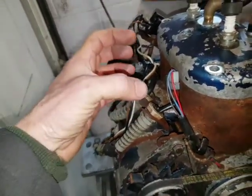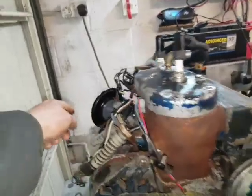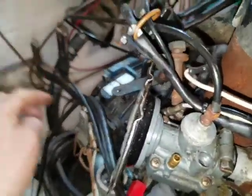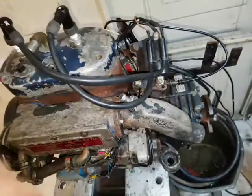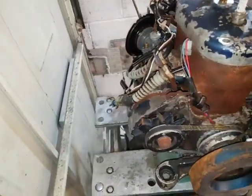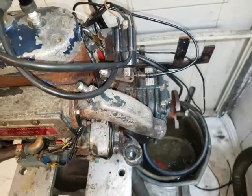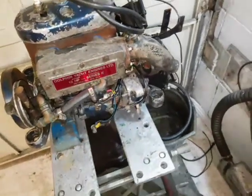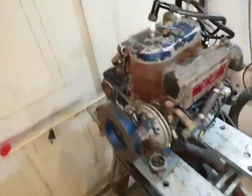If you look at the Vire, the carburetor is right up here, right where you can get at it. You can change all the linkages, the adjustments, same with the gear stick. With the Dolphin, it's all very deep behind. I don't know how you would get down there and adjust the linkages for the gears or the throttle. The only way is to basically make sure there is a hatch you can lift up in the aft of the boat, which this gentleman had, but obviously that compromises your safety in a storm where that removable hatch can leak or even blow off and sink the boat. Most boat builders recommend that there isn't a resealable hatch in the cockpit because it's self-draining and they don't want any issues, plus it weakens the structure of the boat a bit. So with the Vire you wouldn't need that.